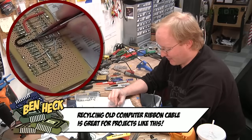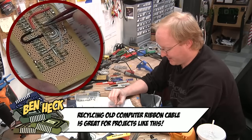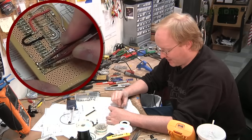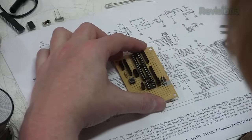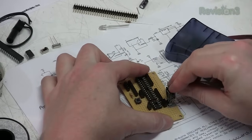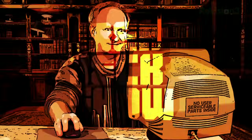Here I have common ground lines wired in. See how we go to the reset switch, the Tiny, and the AT Mega. There's also a positive voltage rail here. And positive and negative voltage also goes to the header jack that we're going to use for programming. This is the jack that you plug your AVR ISP programmer into to program the device.